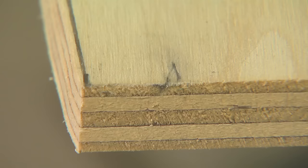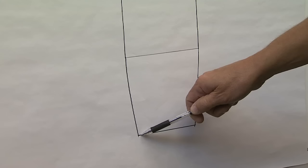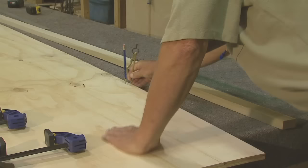We're going to make a 3/4-inch mark down the side so we know where to set our rails. We're going to take our compass, start at the front of the boat, set it on a 3/4 offset, and scribe all the way up our first piece of plywood and stop there. I'll repeat that on the other side.